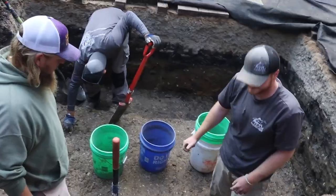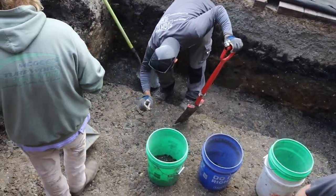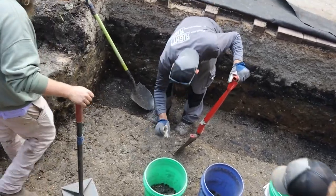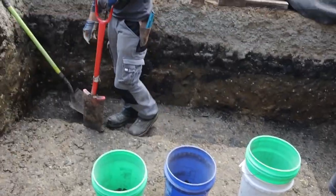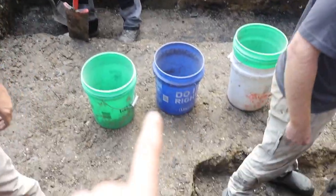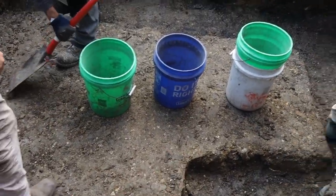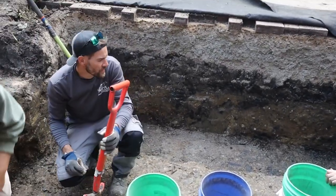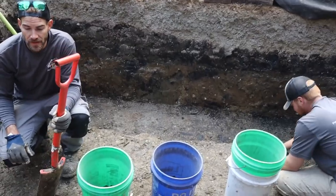We got our trenches dug and our hole excavated, so we are ready for our fabric liner and fabric, and we're gonna be able to get going on this so far. So as you guys normally know about how we normally do our walls, because it's become a norm on our videos now, is that we go down to our depth, which is 30 inches here, and then we went down another, Dan, what was that, another, we went to 38 inches? 40, average of 42. 42 inches.